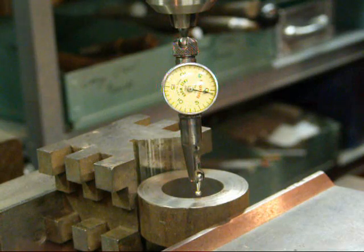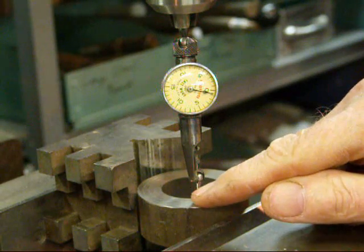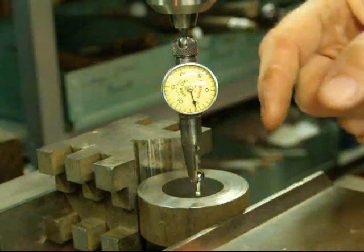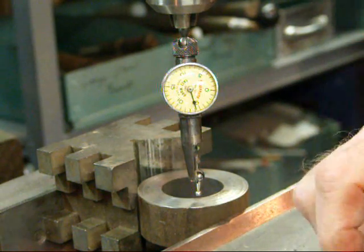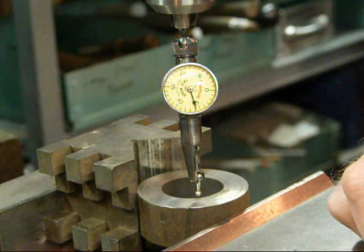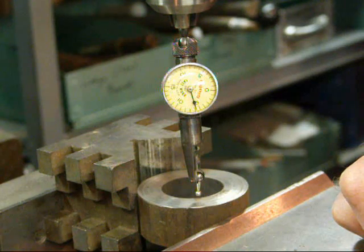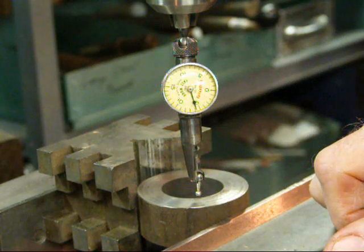Raise the quill to get that out of there and we're essentially done. Now when you do this, these indicators are reversible — we can make it so that when I push it this way we'll get a reading, or there's a little lever back here that allows you to take a reading the other way. So if you were going to sweep this around a shaft, like I showed you earlier, you would need to use your indicator in the other mode. In the next video I'm going to show you how to do the actual boring — we'll put a boring head in here. I had several requests for that. If this was useful to you, let me know and I'll put more videos on that are similar to this. I hope this was helpful to you in showing you how to find the true center of a hole. Tubal Cain saying so long for now.